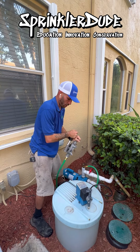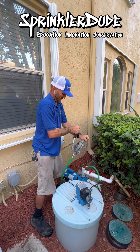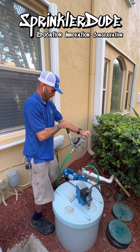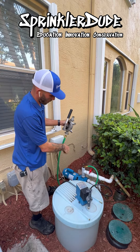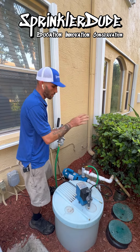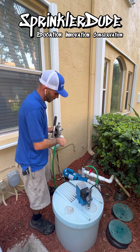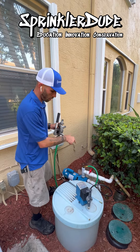You could feel it when the water gets close. And there we go. Now that we've got water all the way to the head of the pump, we'll go ahead and disconnect the hose, turn the pump on, and allow it to pull out all the air — because that is a self-priming pump. But we don't want to burn it out trying to prime the pump all the way from the bottom of that well.